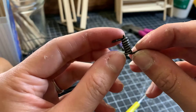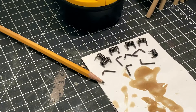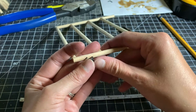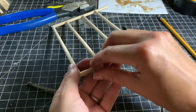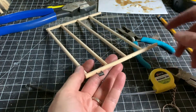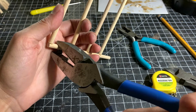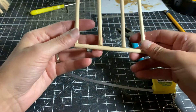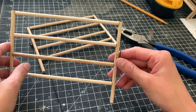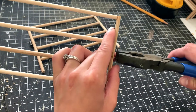I made lots of pins and hinges for this project and got really fast at making them, but my fingers were pretty sore by the end of it. If you press the hinge prongs into the wood it will leave an impression showing you where to drill. Then you can dip the prongs in wood glue and insert the hinge. For some of the hinges I had to use pliers to force them in — I counted this as a win since they will be extra sturdy. In demonstration, I tried to remove the pin from the first trial panel and in the end had to use pliers because it was not coming out.